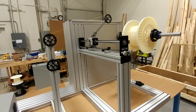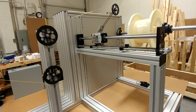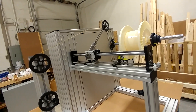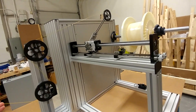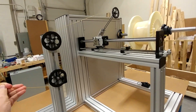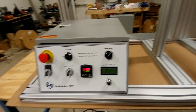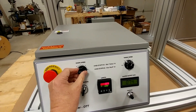You can hear the motor spinning internally, but the spool isn't turning yet because the payoff isn't turning — it's just slipping at the tension we set. I can pull back on the filament and you can see the take-up spool trying to turn. It will turn when I give back some slack, but it doesn't resist too hard to my pulling, and I can adjust that pulling force with the tension knob.